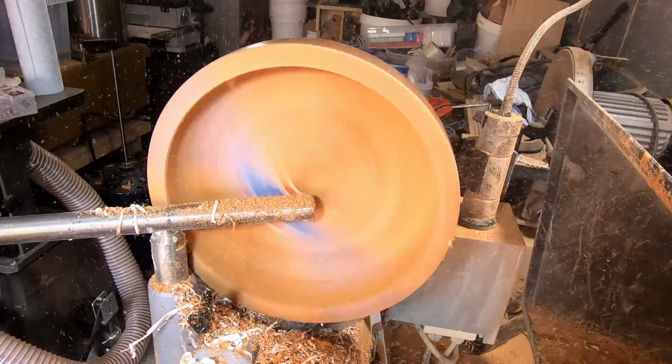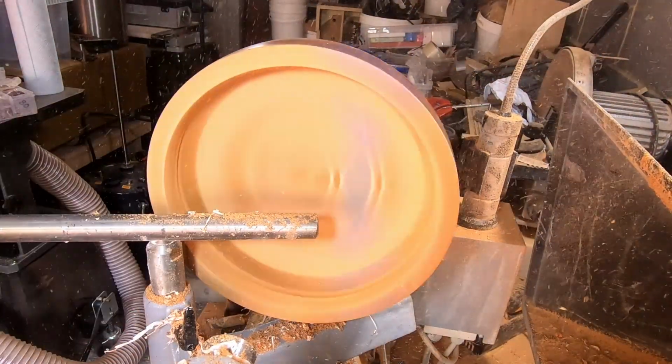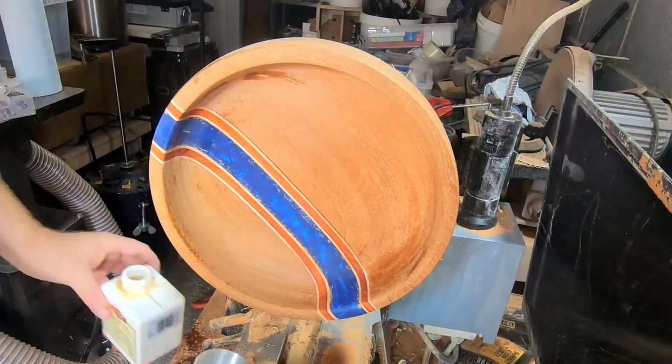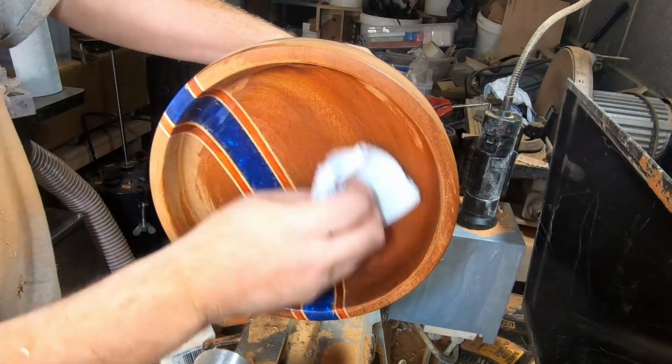A final check and a fine tune from the carbide cutter, and it was ready for sanding, same as before, from 80 to 400 grit. After a thorough clean down with denatured alcohol, I applied sanding sealer, which was denibbed with a non-abrasive pad.